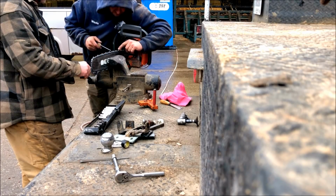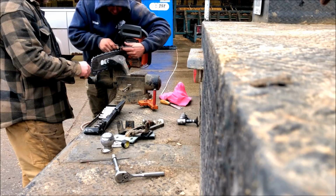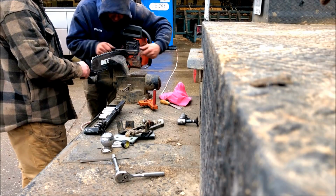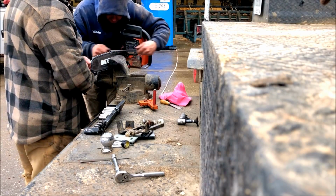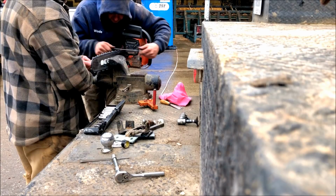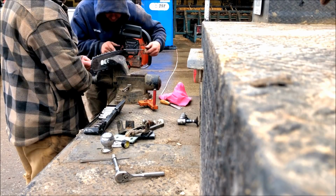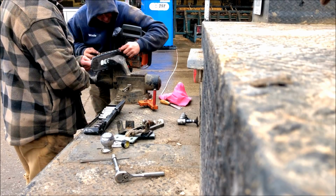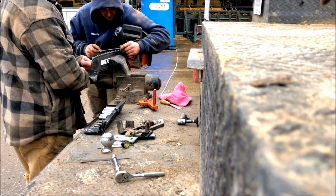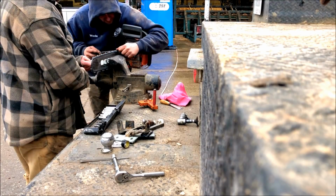That I really like. I like that distance, and that's about where I like my teeth anyway. You know, where this one's pretty new yet here. But I don't worry as much about counting strokes. I get it sharp, number one, because I'm taking my depth gauges according to each tooth. So, you know what I mean?